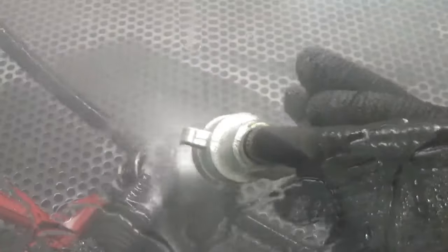Now, one of the downsides to wet soda blasting — before I continue down this path of why it's good — is that soda blasting cannot really change the appearance of a part. It's too soft, too fragile, too friable. When it actually hits the surface, it essentially explodes. So it's a really good cleaning process, but it's actually not a good finishing or preparation process.